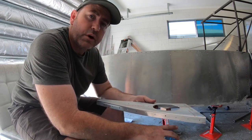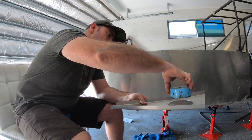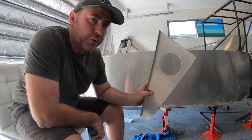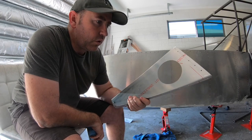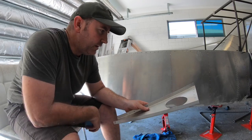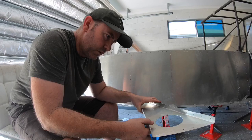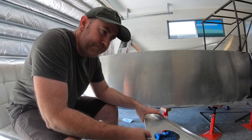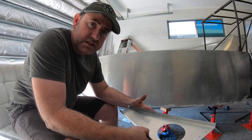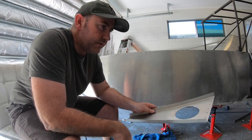You've got to have timber underneath it. You lay it down on the timber, drill down and in on an angle, and it will cut a really nice, neat hole. So I'll get into doing one and show you. It looks dangerous — it's not, trust me. The key is, when you've got the part down on the timber, your foot has to be against the side that will stop it from turning. That's the key.